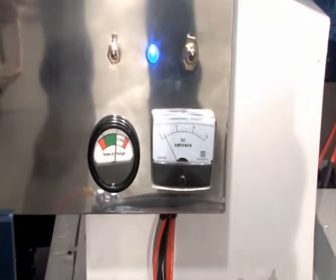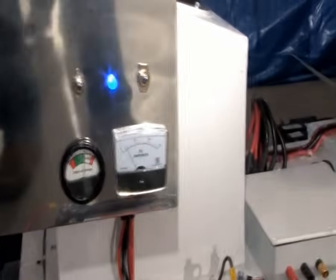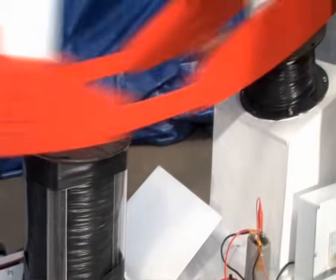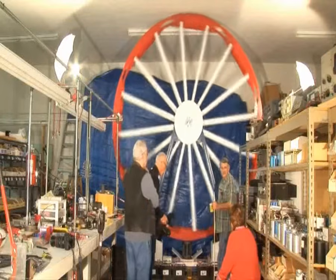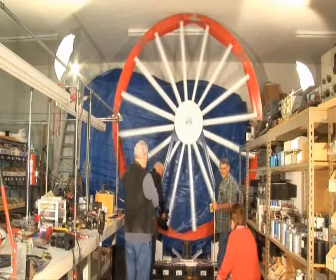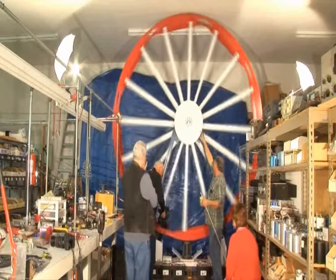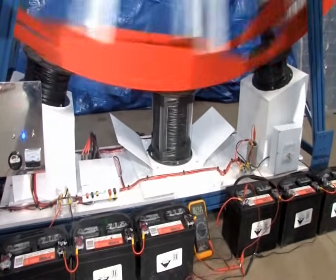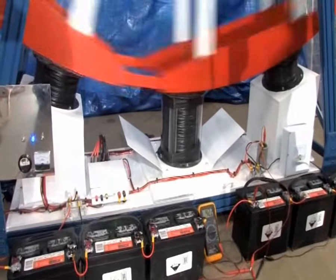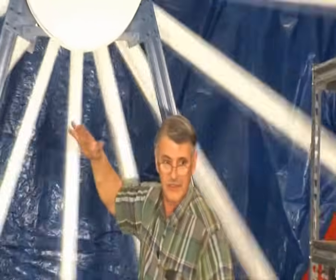So there's your primary again. This is tapering off because this is at 42 volts now, so the batteries aren't requiring any current from the machine. Okay. Cool. So basically, Pat, the machine's running wild right now, but servoed, because it's in this magnetic lock. The machine basically wants to run, right? Wants to take off and go. But we're limiting it because of this generator now. We're holding the machine under a torque load.